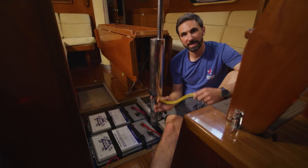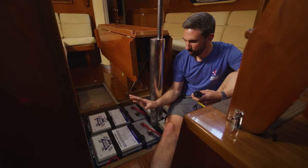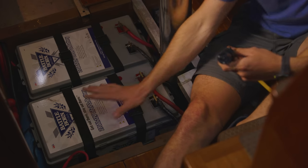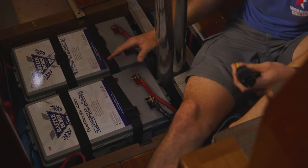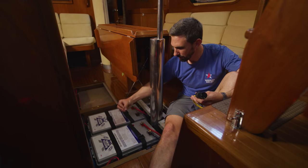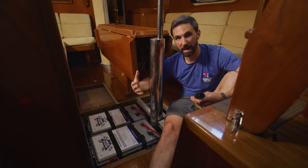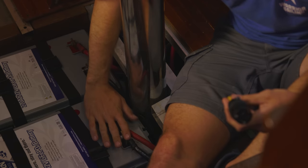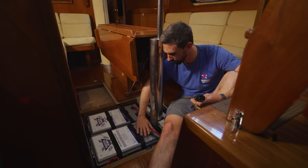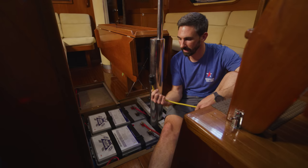When it comes to safety on a boat, there are two main concerns. DC batteries contain a lot of stored power, but it's at a low voltage. When there's low voltage, there's less potential to jump across and shock you. For instance, at 12 volts, I can put my hand across these terminals and there's no electrocution — so it's very safe from an electrocution standpoint. But that's different than AC power.